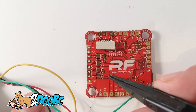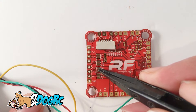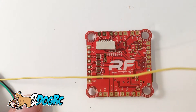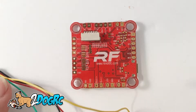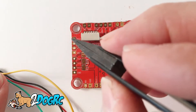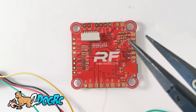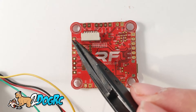Since we're using TX1, you want to do invert on TX1 on the ReVolt — bridge the middle solder pad to the inverse one, which is the top. Now, to get your telemetry to work, you need the yellow wire, which is the third one. This is your S-Port, and S-Port is going to go into RX3, which is up here. You don't have to jumper anything, but it goes to RX3. When you run your wizard, remember it's RX3. If you use the wiring diagram from the RaceFlight build manual, it's very helpful — it's got the label: S-Port, smart port, goes there.